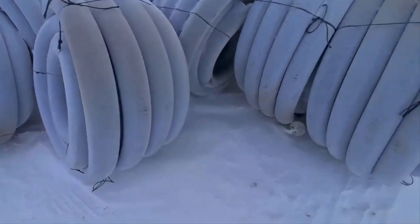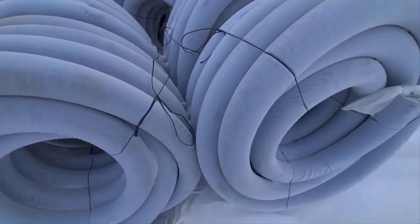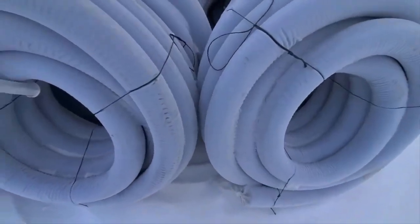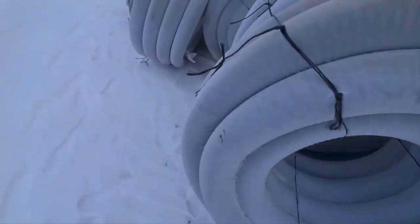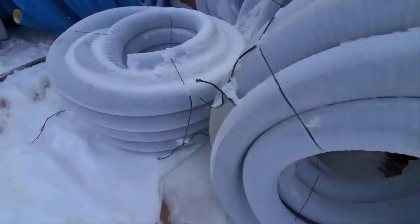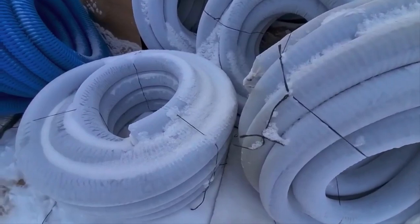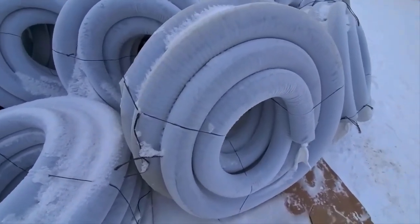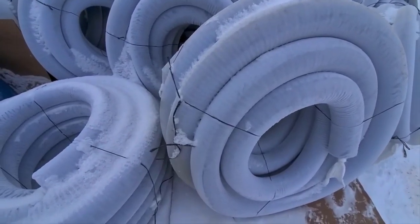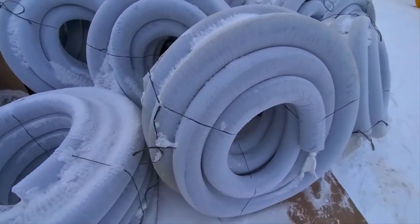That family that wants to tile their small farm and hand-set high octane — we went ahead and had high octane put in a sock for these special situations where you need the sock, because maybe you don't want to put the stone in. You're tiling a big yard and just want to run a bunch of tile. Yes, there are so many ways to drain yards, fields, commercial properties, and sports fields. If you're going to use high octane on a sports field with sand, use the high octane in a sock. We're here to meet everybody's needs — we listen and then we get the job done. We now have high octane in a sock.